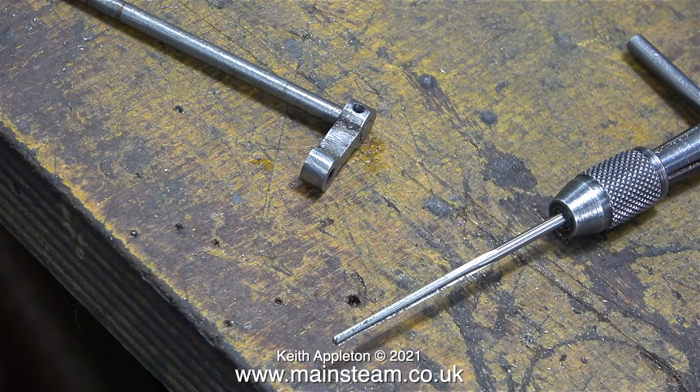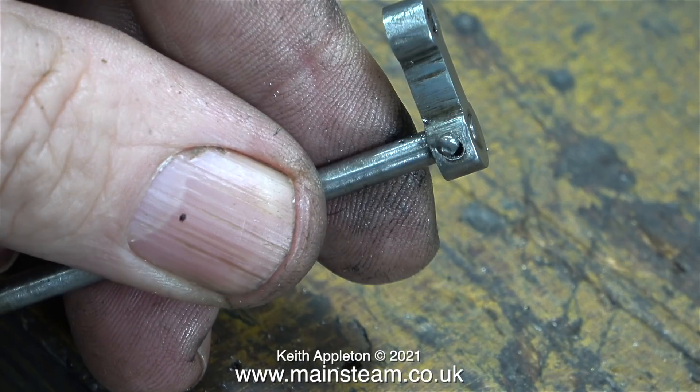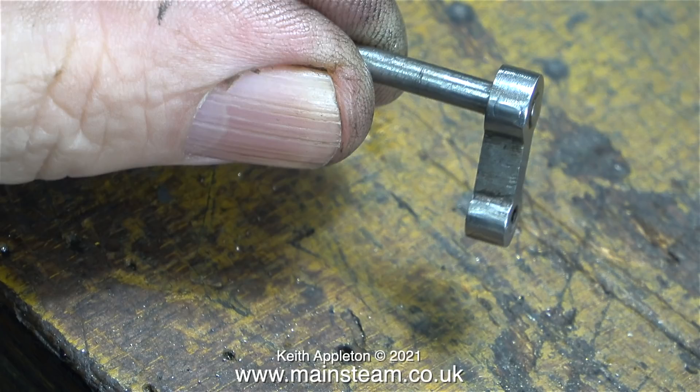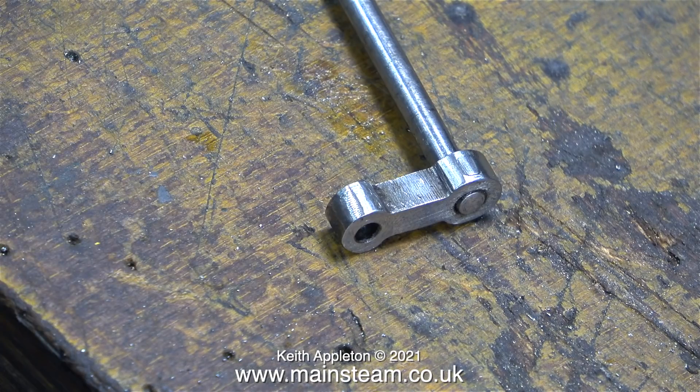The reason I started the reamer through the smaller of the two holes was because at the other side, where I drilled out the bolt, the hole was not in the right position anyway. This clip shows a taper pin that I fitted into the hole — where it came through the centre of the rod, it wasn't in the right position in the hole where the bolt had sheared off. This doesn't look too good, but I have a fix for this — it's called a hammer. I riveted over the taper pin to fill this hole. After riveting, I cleaned up the part using my 1 inch belt sander. Not perfect, but a lot better than it was. With a combination of Loctite, a taper pin, and then riveting over the taper pin, this arm is never going to move on this shaft again.